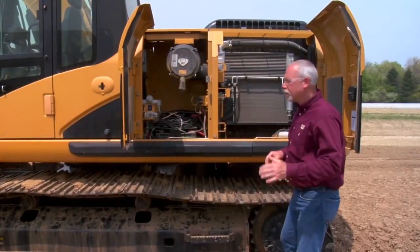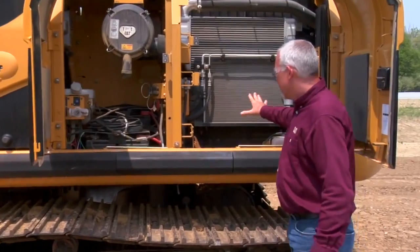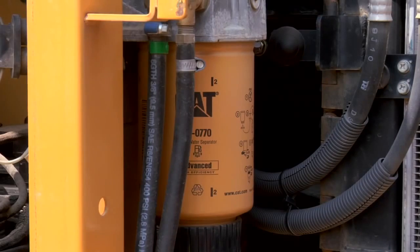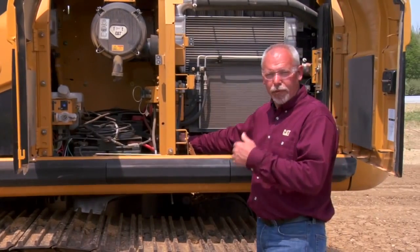In this compartment, we're going to look at our coolers and make sure they're clean and free of debris. They can pack up with debris, leaves, and stuff like that — that's the kind of thing that can make the machine run hot. Over in here we also have the fuel water separator drain, which is a daily check: we drain a little sediment and water out of that bowl if it has any in it.